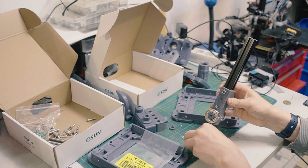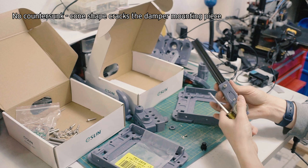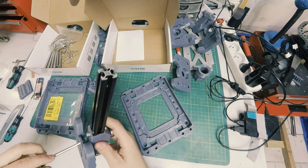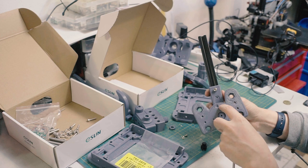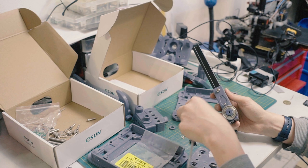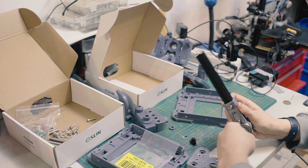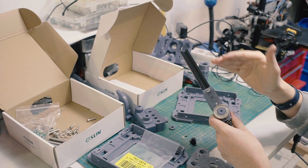And these are Phillips heads, but you can use whatever flavor you like for this. And if I jump ahead a little bit, on the gears, there's actually an access hole. So when the gimbal's assembled, you can still remove them, if they break, because I don't know how durable these things are. I've been testing them, but after a year or so, maybe they'll fail. Also if you want to add them after the fact. And with the teeth engagement, there's maybe a millimeter of play vertically. So once I have an axis all squared up, I'll loosen these screws, run the gear back and forth along the teeth, and then tighten. That'll help adjust the gear mesh distance.